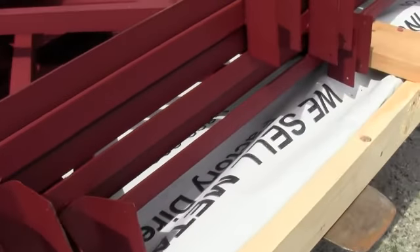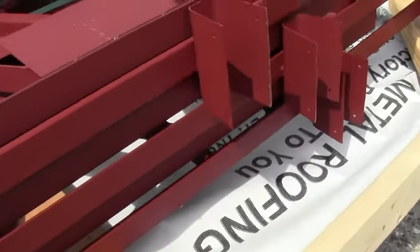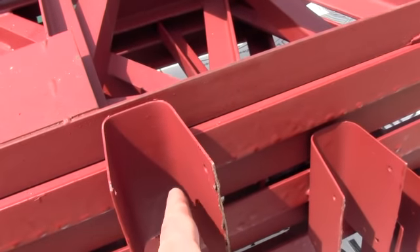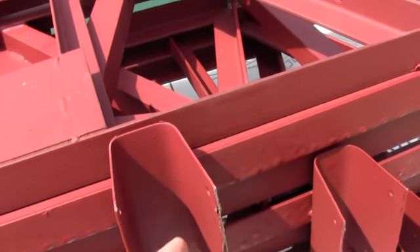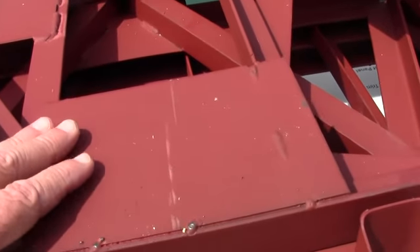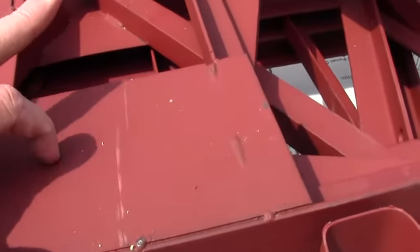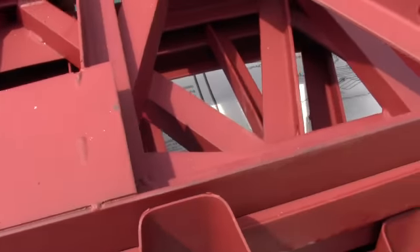The kits come with everything — all your hardware, all your 2x6 purlins. We use yellow pine to go in between your purlins; most of the time you can't get yellow pine. This one's got the gable plates on it. If you're enclosing your gables later, you can just screw right to your gable plate with your 2x's, and that makes it real easy.